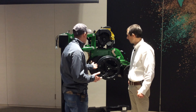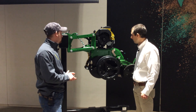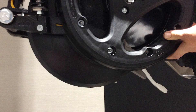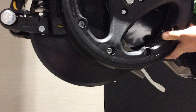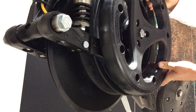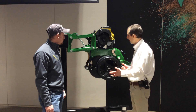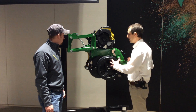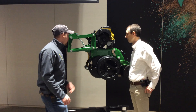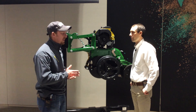We've got a split gauge wheel and we're not using a coulter — what are the advantages of going that route versus the competition? Knives come with quite a few advantages. Number one, they're simple — not a lot of moving parts. Number two, they have a really good delivery option, not letting go of the fertilizer until it's already in the ground, so we're not trying to squirt, dribble, or inject. And thirdly, the packaging of a knife keeps it confined in a very tight package, so our weight is going to be considerably less than the competition.